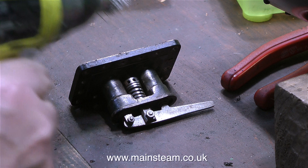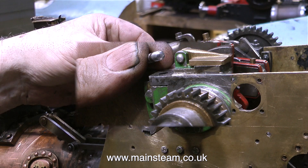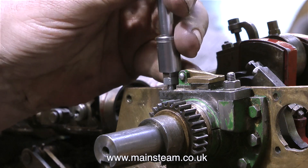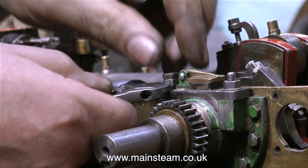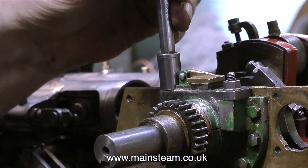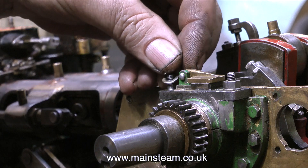This is a ram's bottom type safety valve unit and I'm just cleaning it up using a wire brush in the electric drill. The time has come to sort out this stud — I really can't use a stud like this on this engine, it's really chewed up. So John made me a new one; it seemed like a good idea because he was working on the lathe at the time. All I had to do was polish up the end of it and fit it into the hole in the main casting. Just in case you haven't seen any of my previous videos, this is how I fit studs to model steam engines — it's quite simple, I just use a couple of lock nuts, tighten them onto the stud itself, and then simply screw the stud into the hole. I use some retainer — not a Loctite product but an equivalent — to make sure that the stud stays in the hole and doesn't come loose when you undo the nut at a future time.